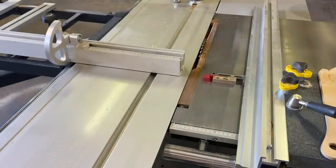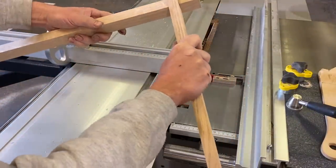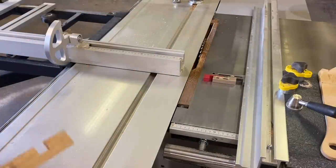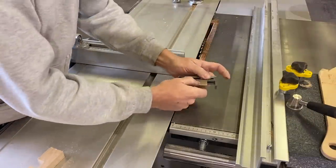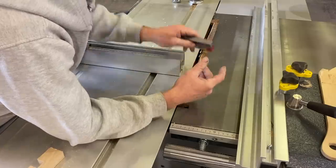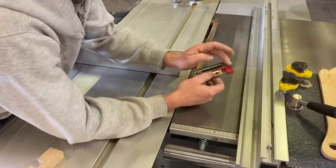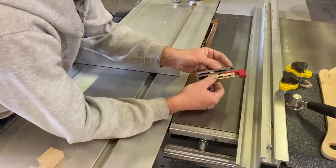That blade's a bit rough on there - needs sharpening - but you can see that's pretty good. No movement - perfect for a glue-up. Just to take you through it quickly again: the first thing is to bring the gold section all the way back and lock it. Then adjust your blade kerf, whichever blade you're using, lock that down so it's in a fixed position. Unlock that and that is now your rebate size.